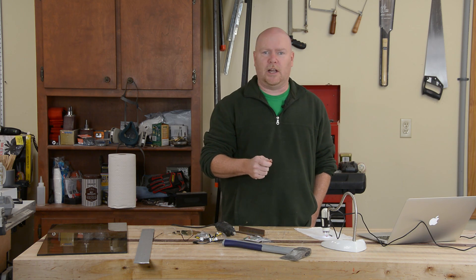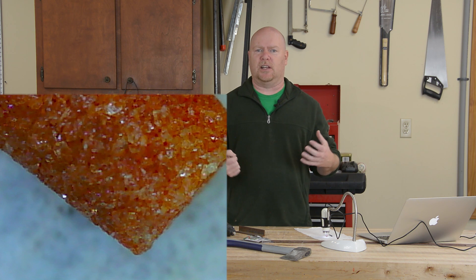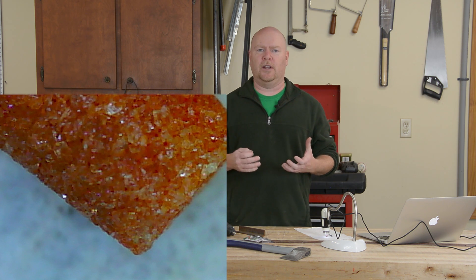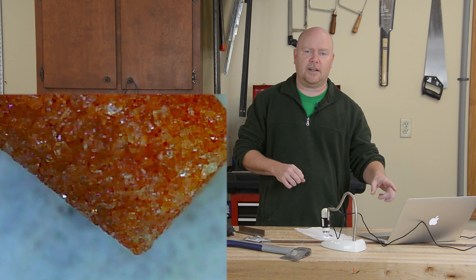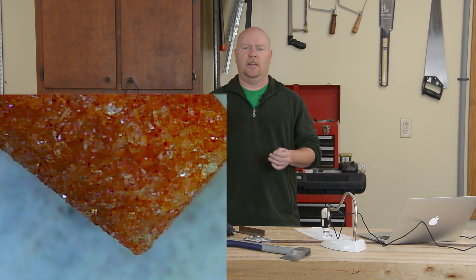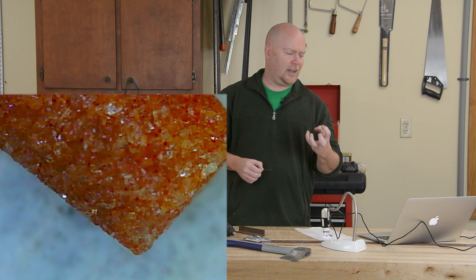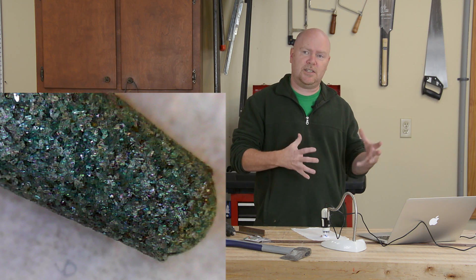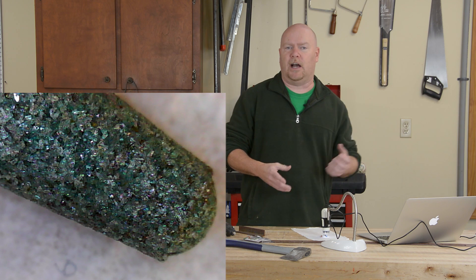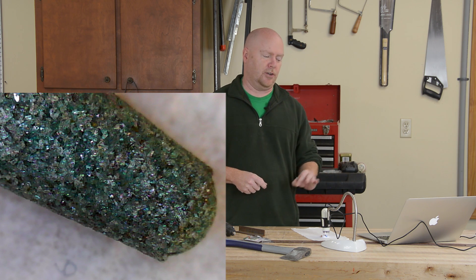First up through our trip under the looking glass is the aluminum oxide stone. What you'll read online is that compared to silicon carbide, the aluminum oxide is a big blocky stone that gouges out the material it's working with rather than cutting it with a sharp edge. You can kind of see that if you look right here along the edge of this grinding bit — there's definitely a wavy bumpy edge. Comparatively, the silicon carbide bit, while not perfectly smooth, clearly has much, much smaller pieces in the material and overall a smoother edge, at least to the brand new surface.